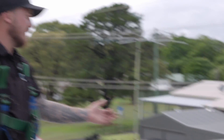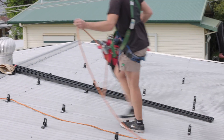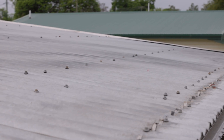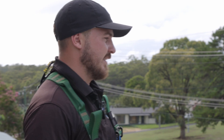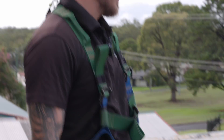As you can see, this house was built in the 1950s — it was actually a settler's house when they built the dam, so it's kind of all over the shot. The roof was probably redone at some point and the screw lines don't match up, so running the rails across in portrait configuration wouldn't work. We're consolidating the panels and flipping them to landscape. It's going to hide all the brackets and look great. A little bit more work for us, but the finished product will be ace.